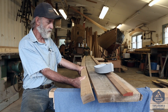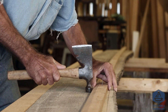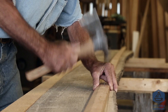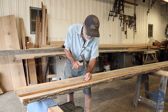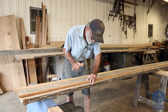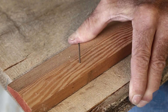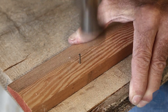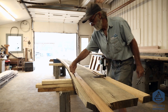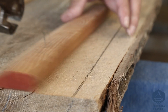It's just a little extra feature that I've decided to put into this particular skiff. Now the next thing we're going to do is rip out another chine log off the other side of the same piece of lumber. The first thing we're going to do is to tack a batten along the edge of this piece of lumber that represents exactly where we'd like to cut it. We want to remove all the sapwood. We want to leave all the good lumber. We want this cut to follow the sweep of the lumber around perfectly. We're going to take a pencil and draw a line along the edge of that first batten. Then we pull the nails and remove the batten.